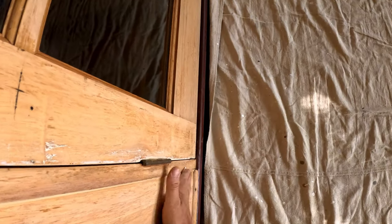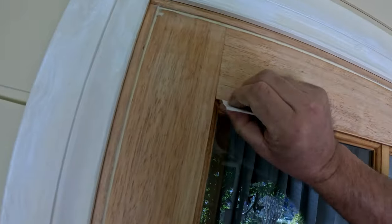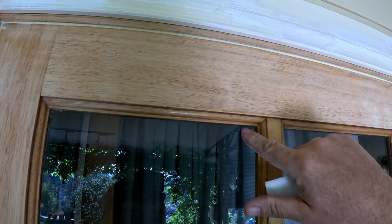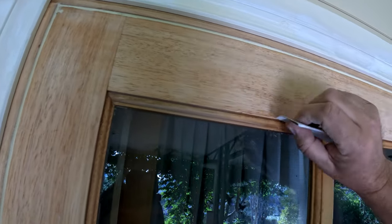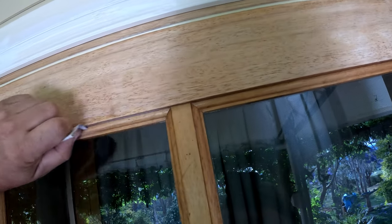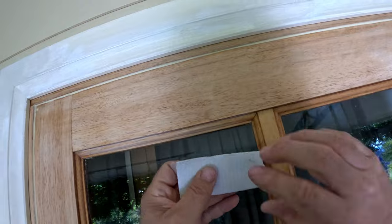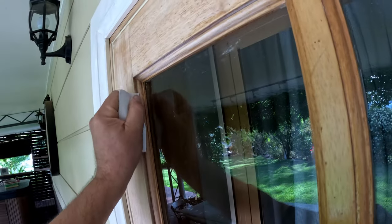I'm going to follow the grain of the timber when sanding. Inside the timber where the glass is, I never go next to the glass because I don't want to damage it with the sandpaper — I don't want to make any scratches. This is one of those fiddly jobs that needs to be done carefully. Because this door was varnished previously, I need to remove all the varnish to make the surface rough for the Zinsser undercoat I'm applying later.